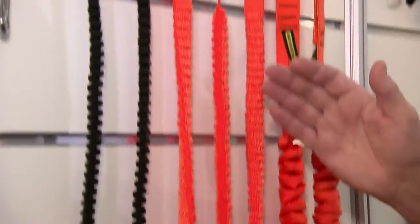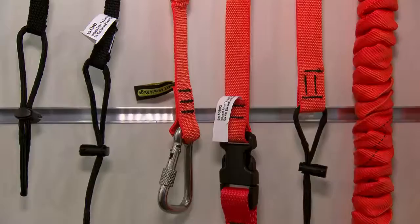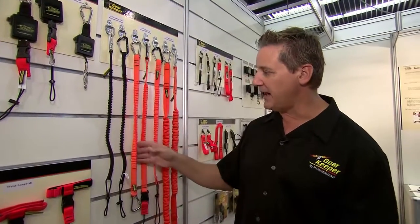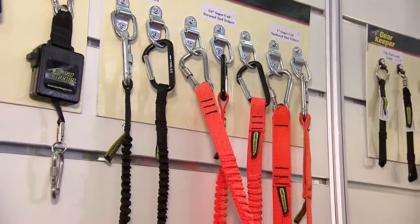Personal tool lanyards or coil type lanyards are the most common in the marketplace. They're the most cost effective and handle the most weight loads. Right now there are no specific standards that tell manufacturers how to test these properties, so it's important to evaluate a product depending on your application. Our tool lanyards have about 60% stretch and it's a very low tension stretch, so when you're working close to yourself you don't have a big coil hanging out, yet you get a very long range without a lot of tension.